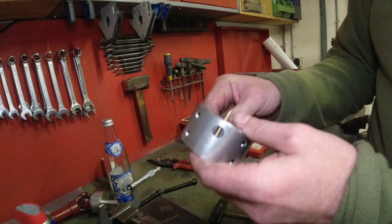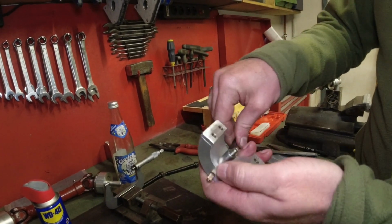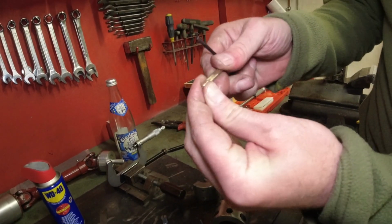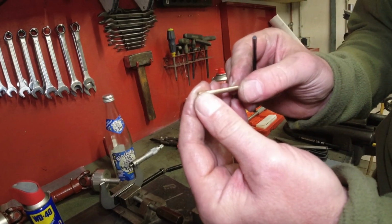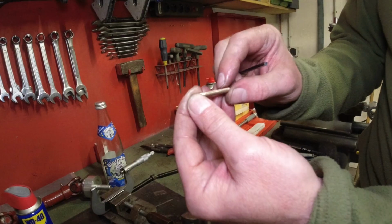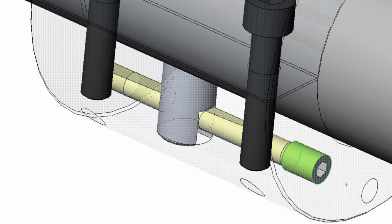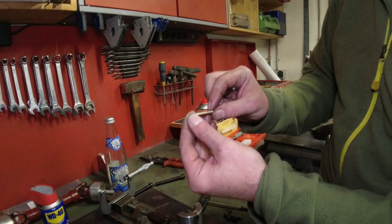Now, the little more difficult piece is the wedge. So if I take the wedge out, okay, and you can see this is a 5mm diameter brass piece, which has a 1 degree taper machined onto it. I think this was actually about 1.5 degree. I kind of eyeballed this. 1 degree would do it, and my drawing shows 1 degree. I just screwed it up.